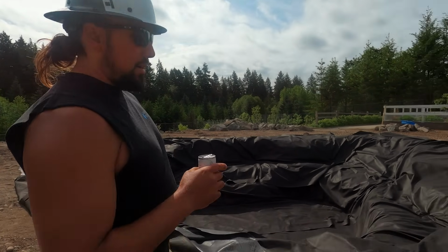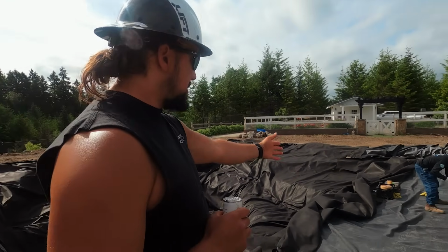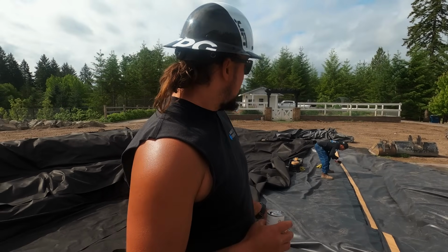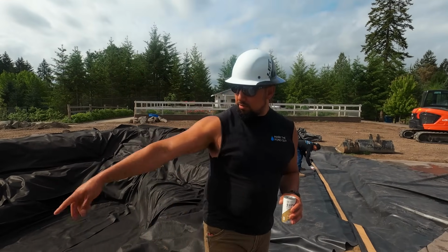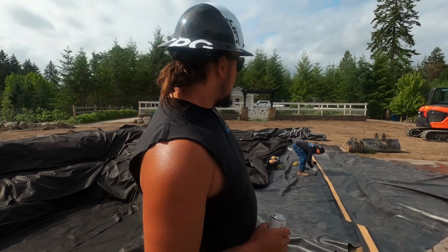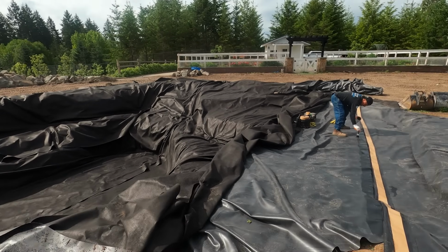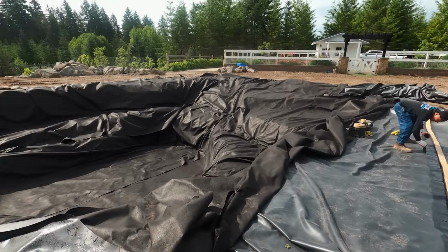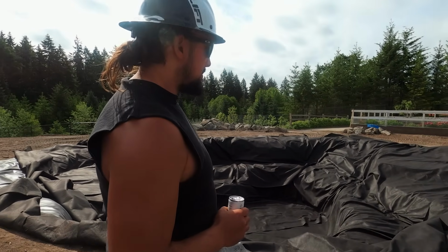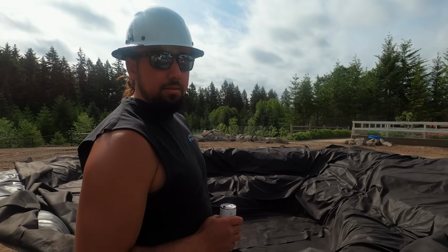So what we're working on now, we took the main pond liner and stopped it right at this edge, just so we didn't waste this. We only have one little section where the beach comes out. So we took a little bit from this corner over here, and now we're seaming it onto this corner just to make this corner reach. So just minimize waste of liner, and we'll have a few more seams to do. Seam on the intake bay, actually just the intake bay, because the pond liner will reach through the wetland filter. So that's what we're working on now. After that, we're waiting on rock, should be here soon. And we'll be flying some rock.